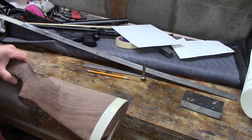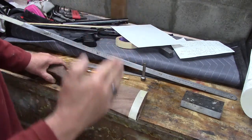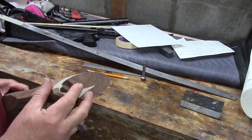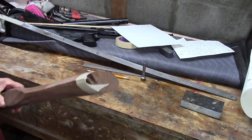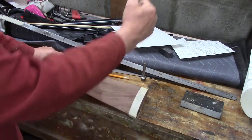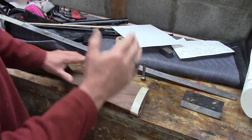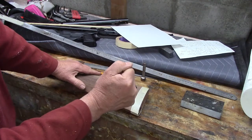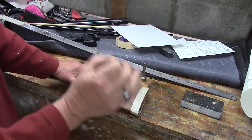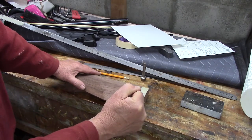There's no going back. So I like to do multiple gentle passes back and forth, going deeper and deeper each time. And the trick to avoid burning, which, like I said, doesn't matter because it's going to be covered up, but why do less than perfect if you're capable of perfection? The trick is don't stop moving. Just stay in constant motion, nice gentle passes back and forth until it's all the way through. And then after the cut, I flex the blade slightly away from the cut because there's some flexibility in any saw. Just pull it away from the cut a little bit and wait for the blade to spin down.